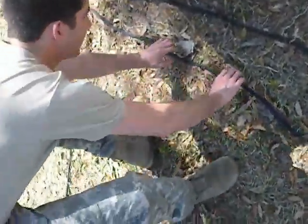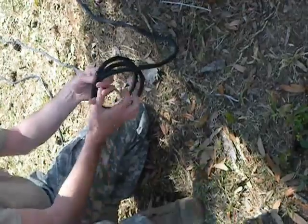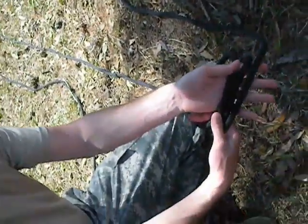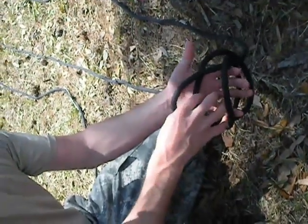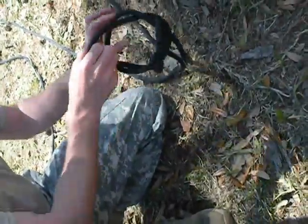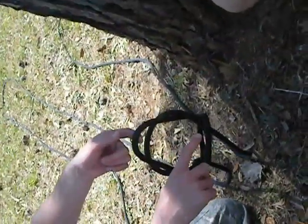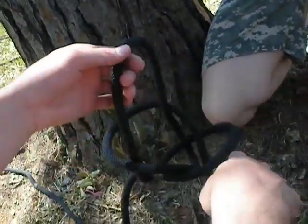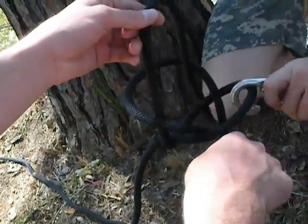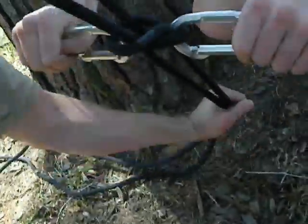The wireman's knot: you pick it up and make three loops — two loops but with three ropes. The easiest way to remember this is middle over left, middle over right, middle over left. Before you pull through, your other clip guy — there are two clip guys — is going to clip this loop and this loop. The two outside loops: one in the center, one on the left, one on the right. Clip the two outside loops, clipping downward.